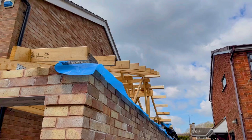And that'll then give me offcuts for the ladder frame on the gable end, which we're also going to do on the truss roof because he now wants a barge board fascia. It's called a barge board, on the end of that now, instead of the traditional undercloak and pointing the tiles on.